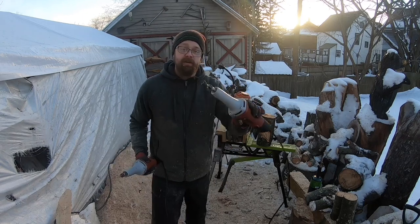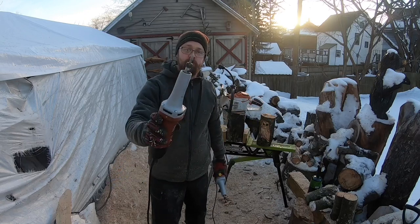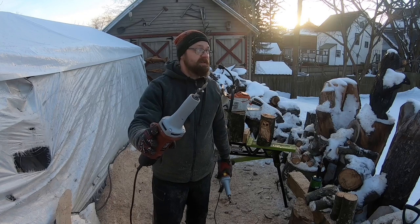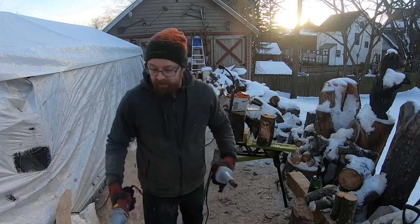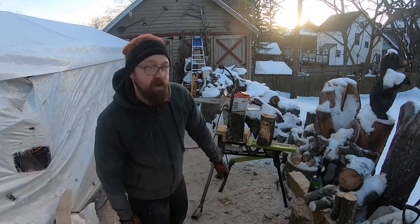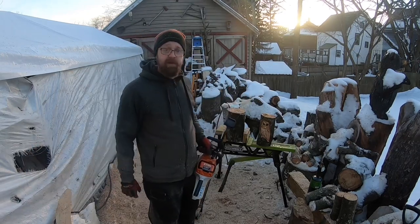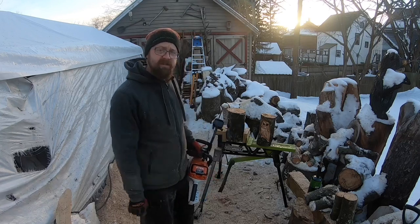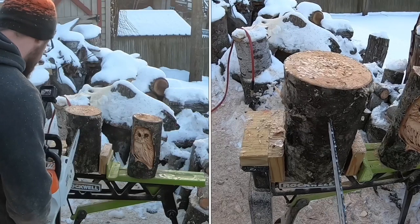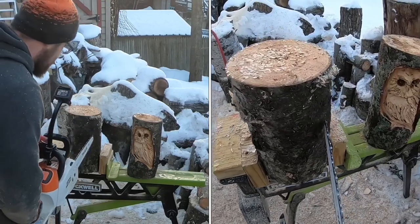We'll also be using the cross cutter three-quarter inch bit for the eyes, and a quarter inch coarse saber-toothed bur bit — both saber-tooth bits in a die grinder for cleanup work. Let's get the camera going and start making some cuts. This is a pretty quick carve, fairly easy for the most part. It's going to basically be plunge cutting.